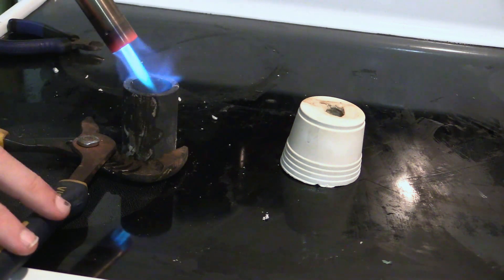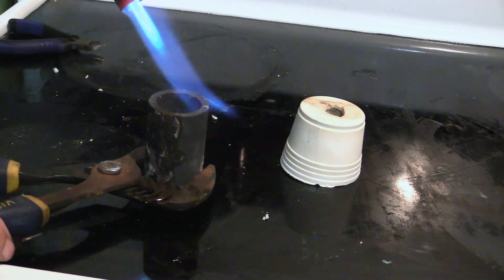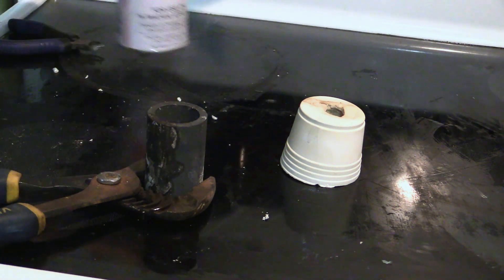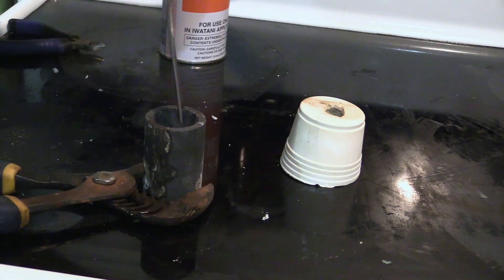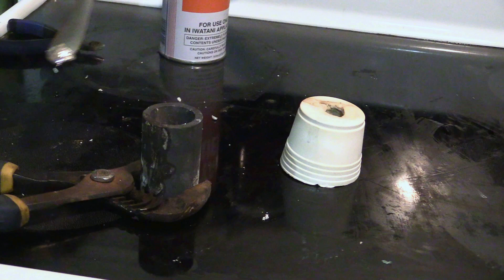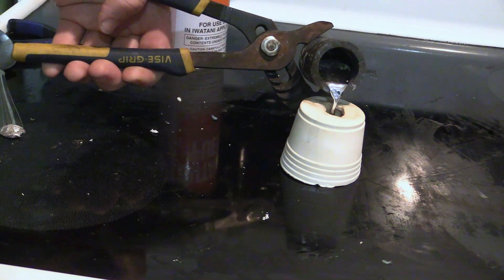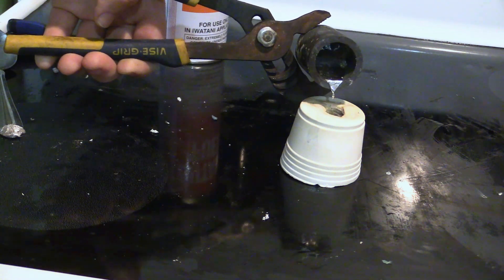Now we are finally at the last casting step — you have to melt the metal. The tin can be melted with a butane torch; you may need an insulated oven to melt higher temperature materials such as aluminum. When the metal is melted, I clean off the top of the tin to reduce contamination, using the handle of a spoon to scrape off that top layer. Carefully pour the metal into the plaster mold. Definitely wear eye protection and heat protection for your body and hands — the metal can splatter and cause very serious burns.